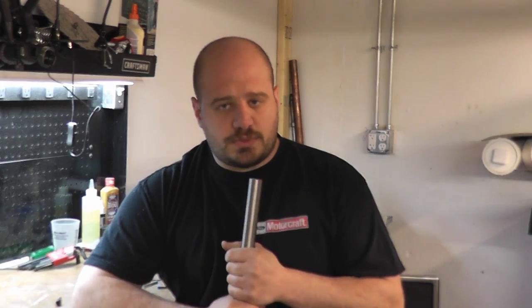This is a one-inch piece. My finger I kind of just eyeballed it and it should work with these sausage fingers. Hers is just going to be a straight band — get a nice radius tool ground into it and dress it up that way. Mine is going to be a little bit wider and have an insert of a different metal, so it'll more than likely need a dovetailed slot. I have to figure out how deep I can go and how much material I have left. But I've got to get my finger measured from a jeweler first because I don't wear rings — the only ring I have is a high school class ring which doesn't fit anymore. We'll see if we can make it out of this, which we should be able to.